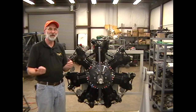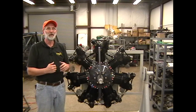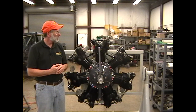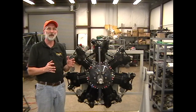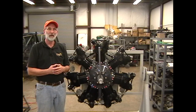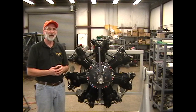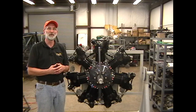Your intentions and what the engine does may be altogether different. And if you're lucky, you may wind up with just broken bones. So any time that you move that propeller, you need to be sure that the magnetos are off and that your switch is working. That propeller needs to be treated like a loaded gun — any time you have a gun, you treat it like it's loaded until you've verified that it's clear. Don't touch it unless you know that the magnetos are off and that there's no possibility of a start.